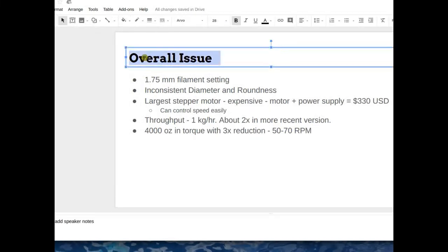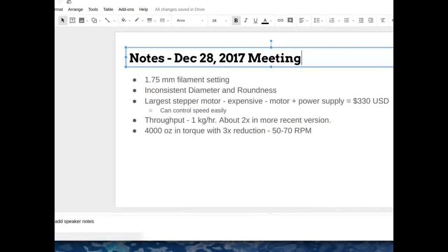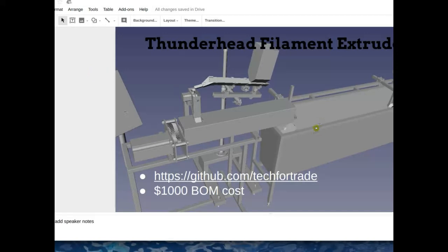Even gravity helps keep flakes from going around in a circle since they'd have to lift up in the air. But when the screw is moving more quickly, I think that also contributes to the flakes not feeding in as well. The cooling tube - is it actually heated? The heating zones are numbered one to five. Zones one and two are on the main barrel, the bent brass tube has two heating zones, and the nozzle has its own heating zone.